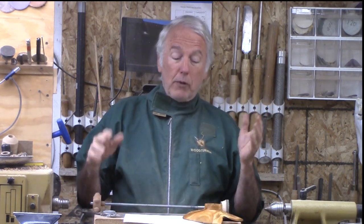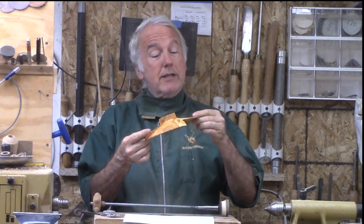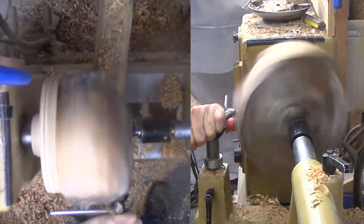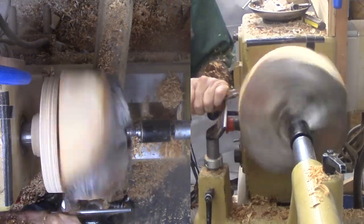Of course, it is not the only way to do it. So let's go ahead and turn this nice decorative bowl — it is pretty — out of cherry. I have clipped the corners from this half log of cherry. Please note the nasty knots coming out towards the live center. The wood is pressed between a spiked faceplate and the live center.